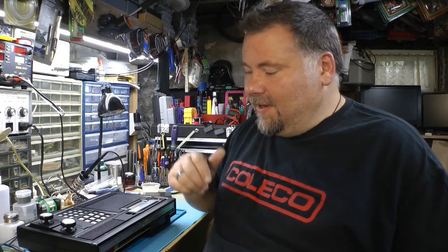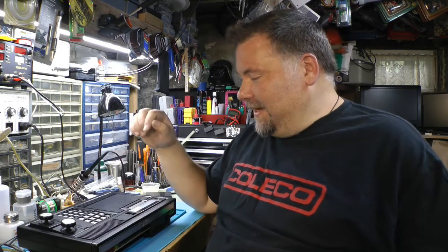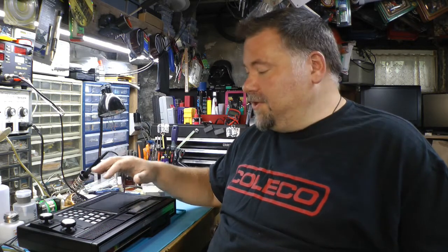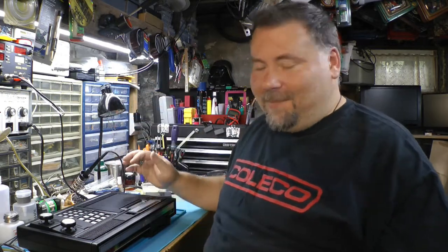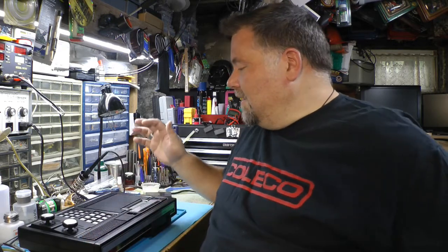We're going to do a no delay BIOS chip mod. So we're going to stop this thing from having to wait 8 seconds before you start every single game. We are also going to do a controller chip ground mod, which is going to save the life of our controller chips in here. They short out really easy, unplugging these things and plugging them in, static on the carpet, stuff like that. You cause issues in there. So we're going to take care of that problem.